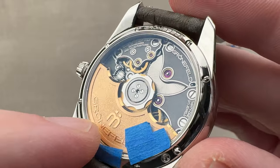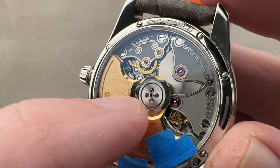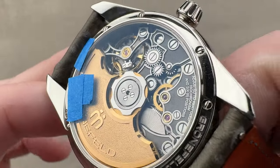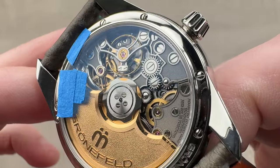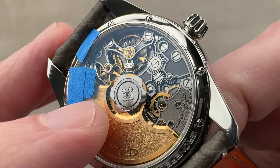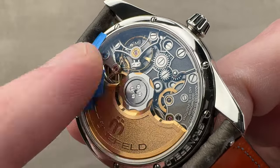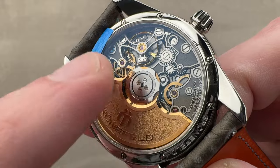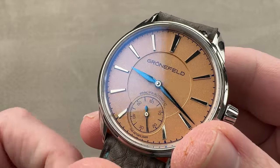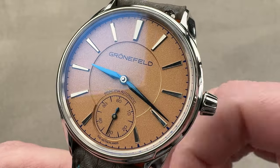This is a gorgeous movement with bridges of stainless steel. And you might ask why — stainless steel is a very difficult material to finish, so why use it? Because it is a very difficult material to finish. The Grunefeld brothers have an impressive pedigree as watchmakers, having worked at Audemars Piguet Renaud et Papi and even done contract finishing of parts for APRP later on as independents — which is to say their pedigree in finishing is second to none, which is why this is a beautiful movement. Not to be mistaken with, for example, what you see in the Streller Cerna using the same basic train architecture. This stands on its own four lugs. Reach out to tmaso@thewatchbox.com for purchase and pricing details.